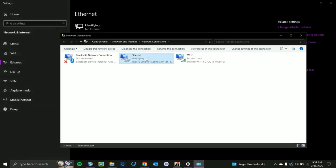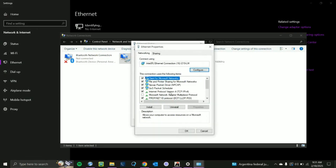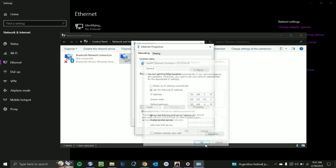What we need to do now is change our Ethernet adapter settings. We're going to go to Change Adapter Options, go to our Ethernet, go to Properties, go to Internet Protocol Version 4, and then type in our own IP address. We'll go with .0.57 — you want to make sure you're on the same subnet. Then make sure you have a default gateway, which is very important.